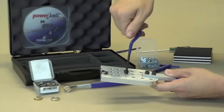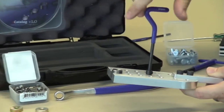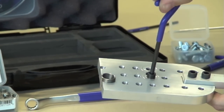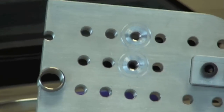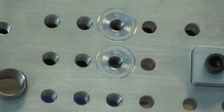As the collar is getting closer to the parent material, you can just slow down a bit and have a look. The ideal depth for installing an insert is about one to one and a half turns below the surface. That's pretty good.